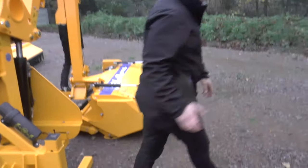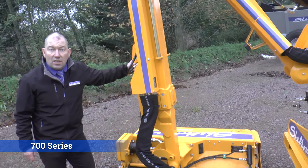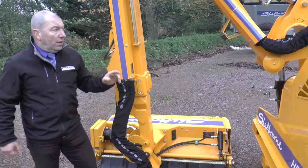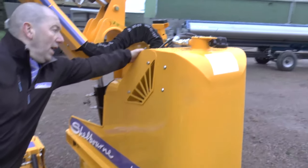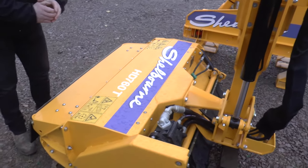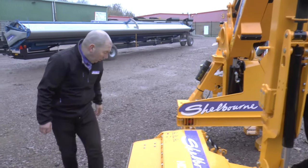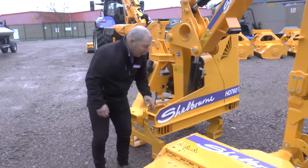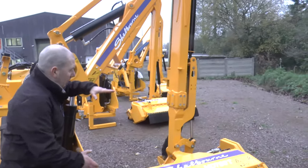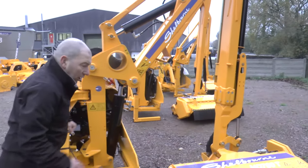That's the 600 series. Now this model is our bread and butter machine. We've built and sold more of this model — the 6 metre telescopic 760T — over the last 20 years than any other model. It's served us very, very well and pretty much comes complete with everything that you would need. You've got your oil cooling system, 70 horsepower pumps and motors. We've got a heavy duty head — typically we would be fitting drop forged T-flails or cast C-flails, competition type flails. Nice and compact, smoothed off at the idle end so you don't drag all the brambles along with you. Telescopic, heavy duty — with it telescoped in that's 4.8 metres reach, and fully boomed out just over 6 metres reach from the centre of the machine to the last flail doing the cutting.